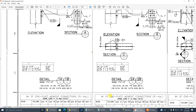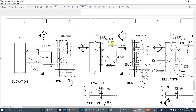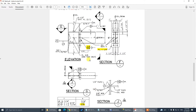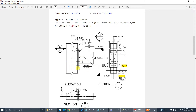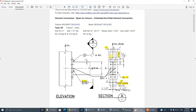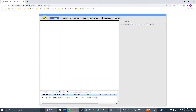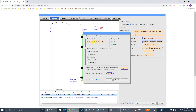We are going to design Type 1b, Type 2a with stiffener plate, and Type 4 with stiffener plate and double plate. The column section is W12x65 and the beam section is W12x45. Before starting, go to Settings and make sure the code is set to American LRFD and the design unit is imperial (kip-feet).